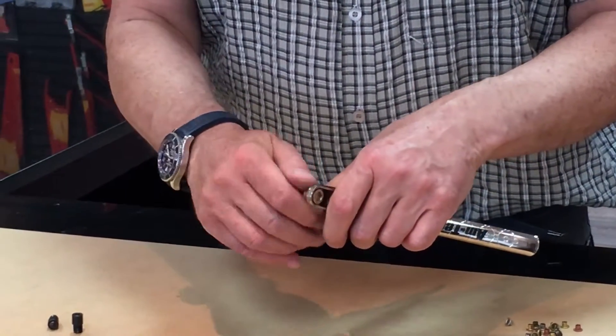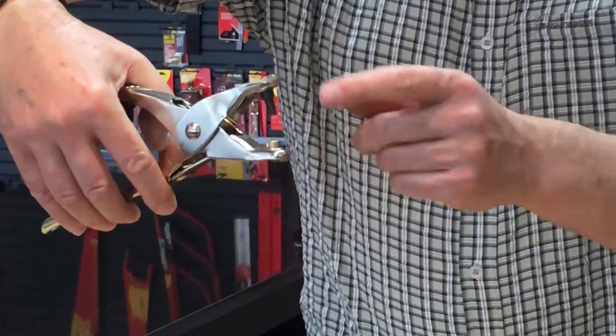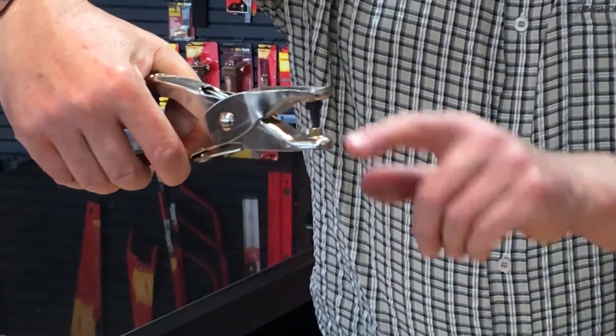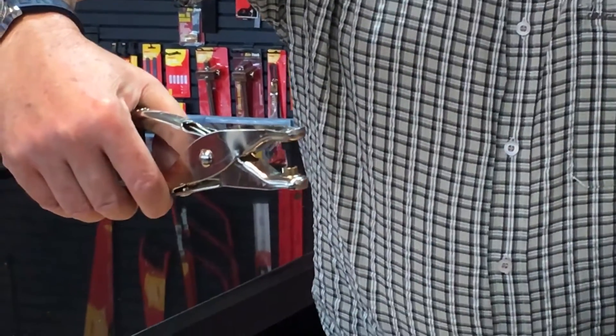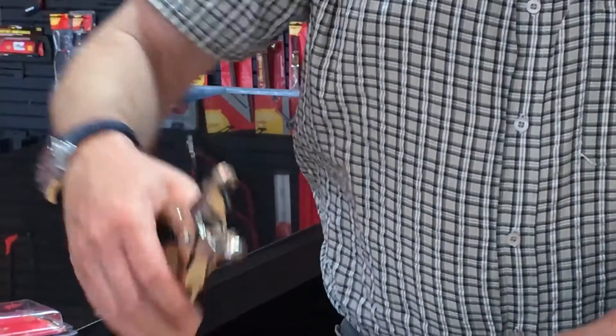On the other thread, screw in the anvil. If you look, there's the anvil — as the die comes down, the punch die comes down, you can see it meets the anvil. That gives you a solid base to crimp on.